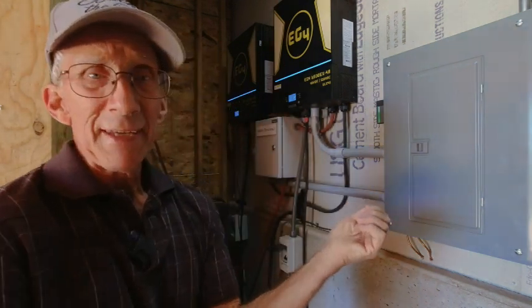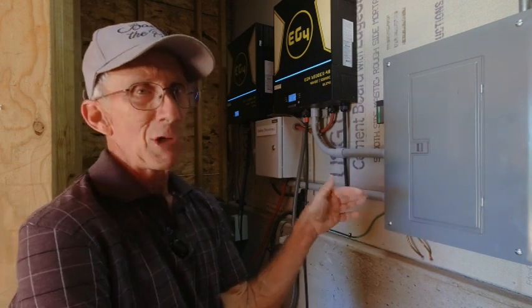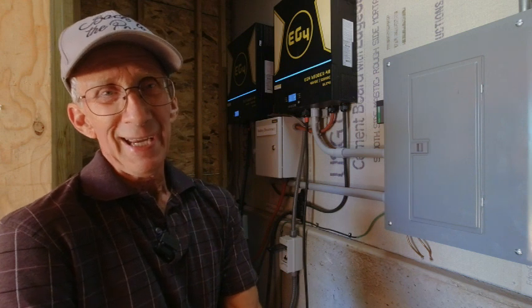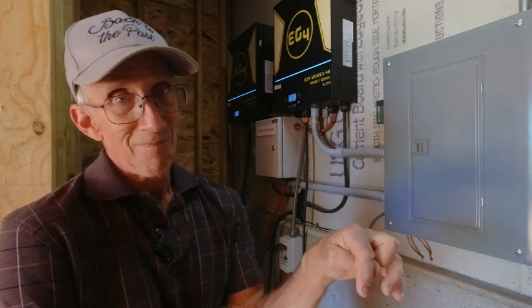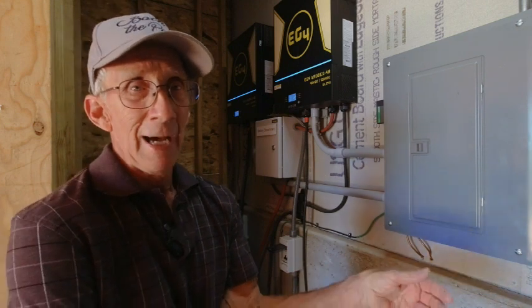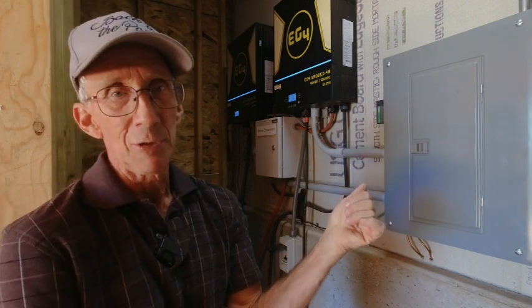The amount of voltage drop from 280 down to 225 is pretty significant for a 30-degree temperature difference and is something that should be figured into your design. I know other people have talked about the drop in power, but I wanted to check it myself and actually put some numbers to it.